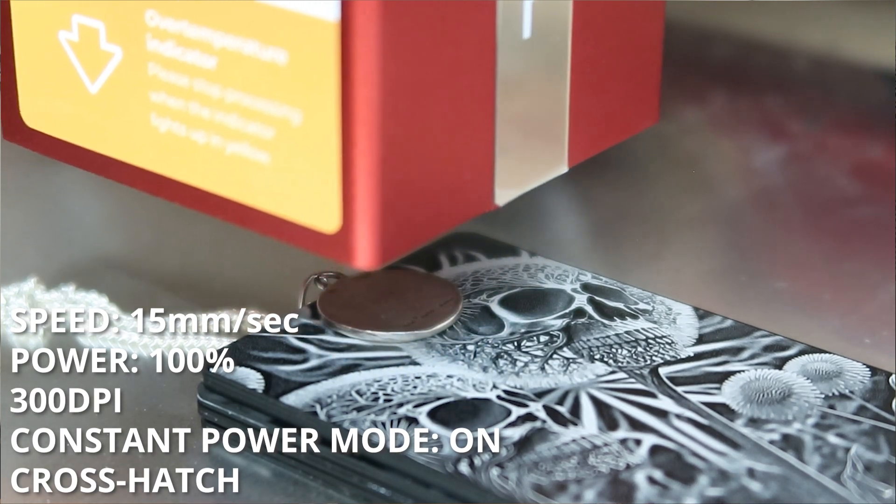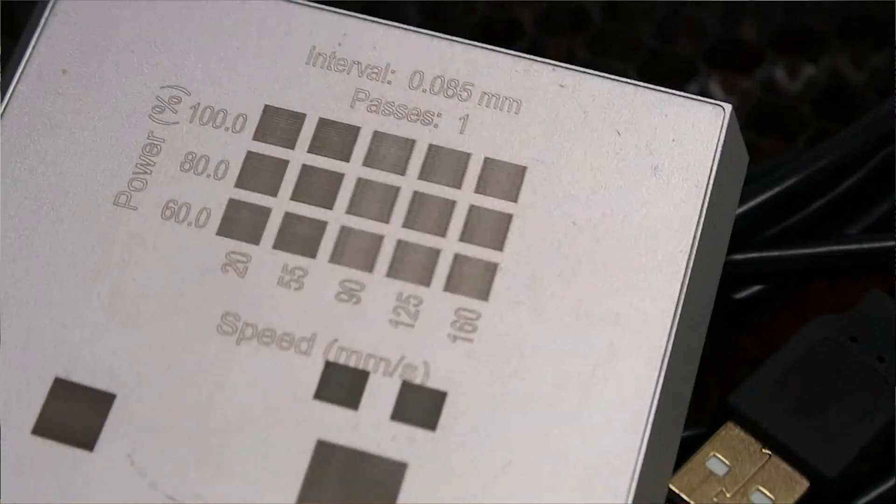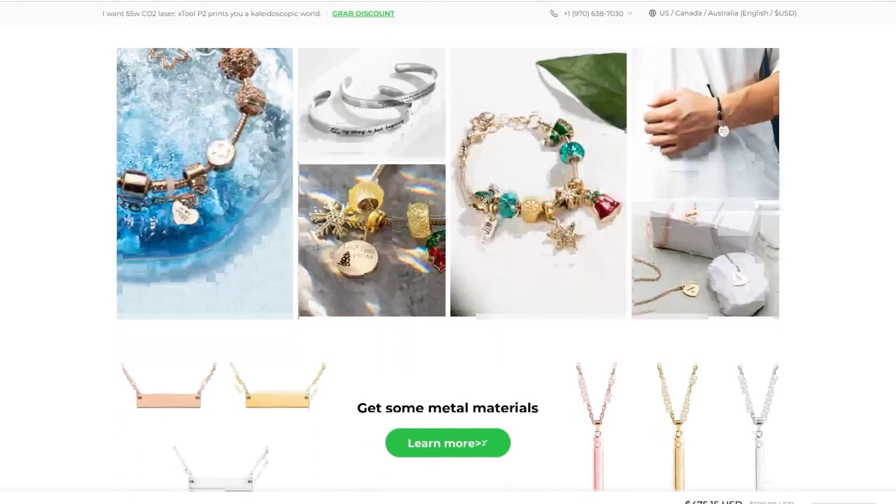Other than that, I didn't come across anything that surprised me. The module advertises some pretty fast engraving speeds, but as you saw in my test pieces, I ran everything in the 10 to 20 millimeters per second range with crosshatch, which essentially doubles the time. I'd imagine if you're just marking an item you could run it a little quicker, but when doing detailed etching on silver jewelry it's going to be a slower process with only two watts of power. On the bright side, you don't have to run extensive material tests — all the metals I worked on I ran at minimum 80% power up to 100% for the brass and silver. It's not like you have any chance of engraving too deep with that amount of laser power, so you might as well just crank it. And the designs you'll be etching on metal jewelry are already pretty small — initials, dates, maybe a little abstract flower design. It's not a lot of ground to cover, so even at slower speeds it still only takes minutes instead of hours.